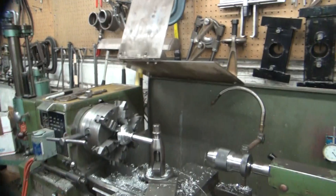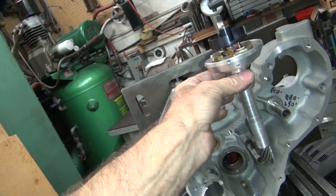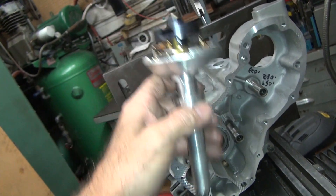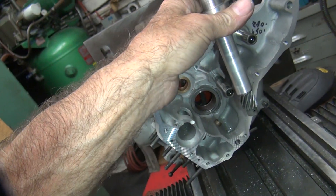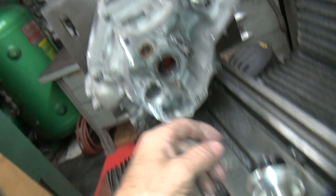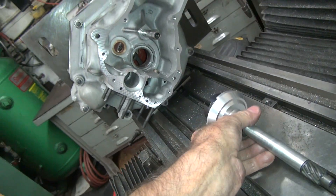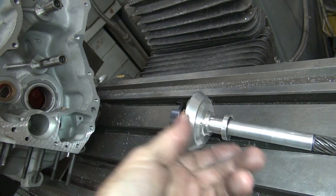Okay, I'll get this camera out of my hand — I need my other hand here to get this out. So now I've got to make a bushing for this, to go in this case over here. I'm going to move this hole over, make a bushing to fit this, and drop it in. I'm only going to cut just enough to make it a round hole — make a thin bushing and drop this in there. Then I'll put the distributor gear in and see if the gear meshes correctly. I can fine-tune a little bit with this one before I go to a full-size one. If I used a full-size one, I wouldn't be able to adjust it as easy. So I don't want to make this hole any bigger than I have to — that's why I turned this down. It was junk anyway. And if you want to save this one, all you've got to do is make a sleeve bushing to go on here and push it up on that — then it'll be a usable one again.